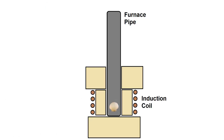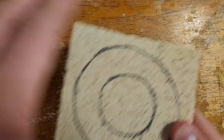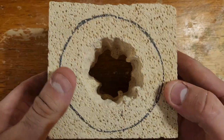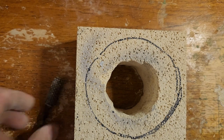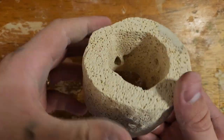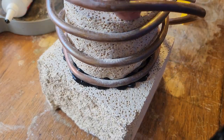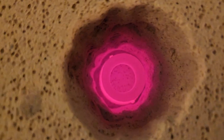The pipe will be heated inside a fire brick enclosure, but the induction coil will be on the outside where it's close to room temperature — the fire brick is invisible to the magnetic fields of the coil. I mark out a square on the fire brick, drill small holes along the marking, knock out the center piece with a hammer, and use a grinder bit to smooth it out — although in retrospect that was a bad idea because the brick completely smoothed out the grinder's teeth. For the last step I use a chisel to carve the outside, then use furnace cement to glue the fire bricks together so the induction coil and the fire brick oven basically form one piece.